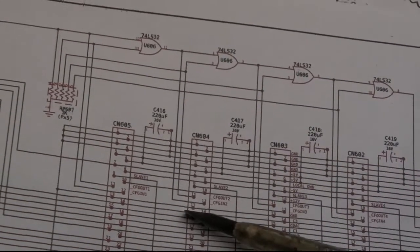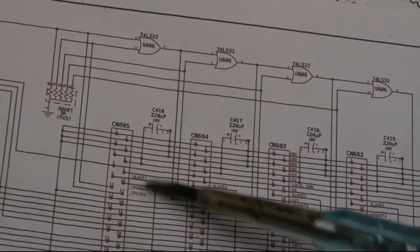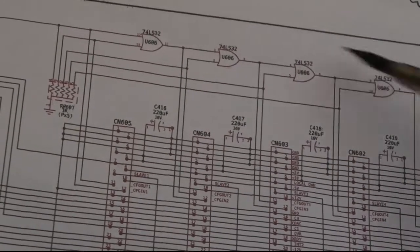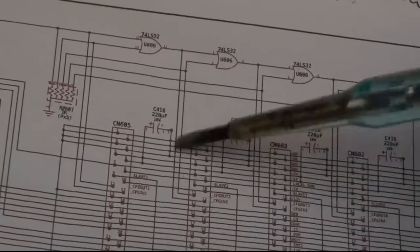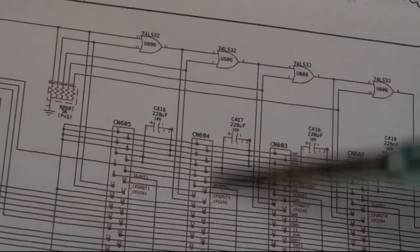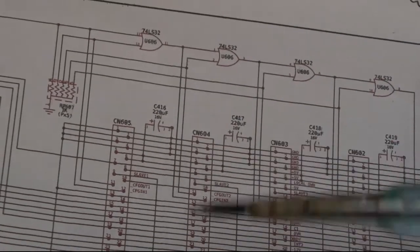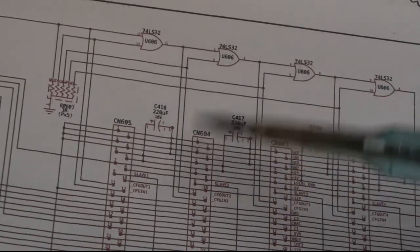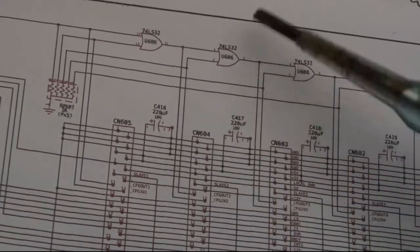But this next slot, as default, just like the first one was, has its out pin high, which passes through this gate and disables the cards to the right. Does that make sense? And that's how it works. It's now dealing with this slot. So this one now responds to the auto config address, identifying what it is and how big it is. And then the system processes and goes, yeah, all right, I can accommodate you. You're all right. Shut up, kind of thing, although shut up might not be the right terminology. That's usually what happens if there's a problem with it.